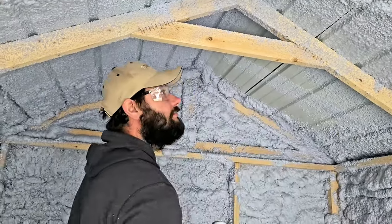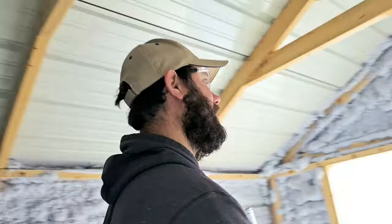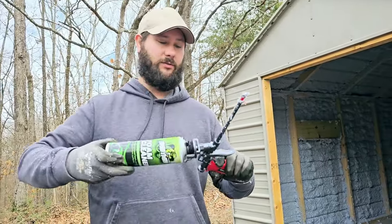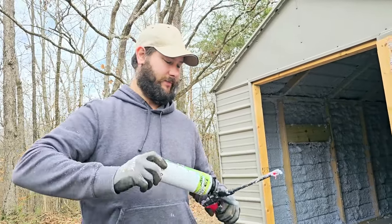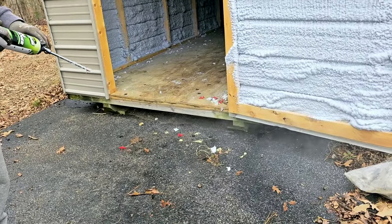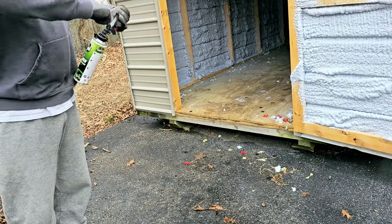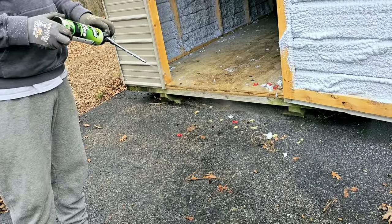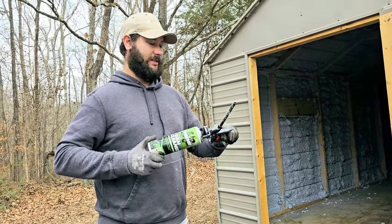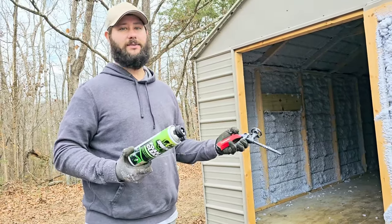Running out. You can see I missed a couple of spots — first time using Tip B for a sealing application. When you're done using the foam gun, you're going to clean it with the foam cleaner so that you can reuse it. Attach the cleaner can and spray it out. Get all that foam off — I should have taken the tip off before doing that. With the tip off and gun cleaned out, I'll be able to reuse this. That's what's nice about buying the kit, and then just buying additional packs of spray foam.